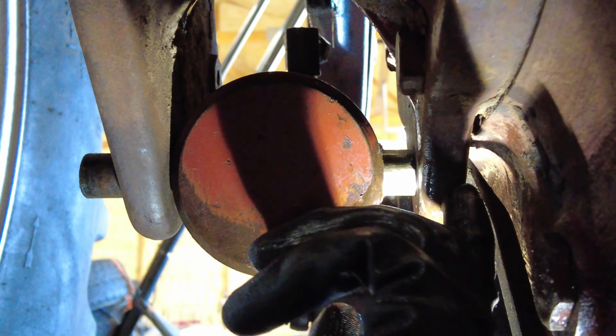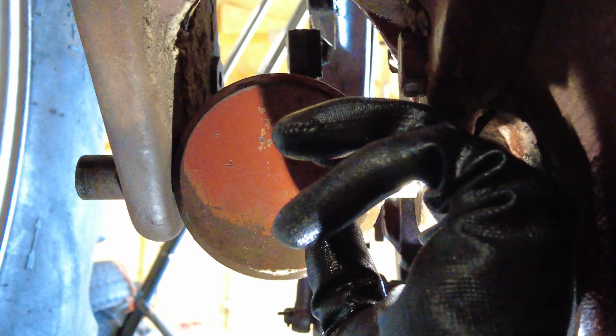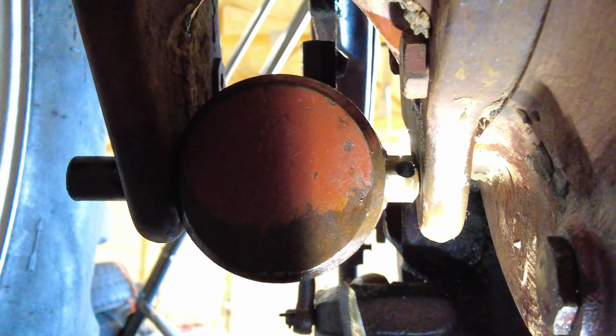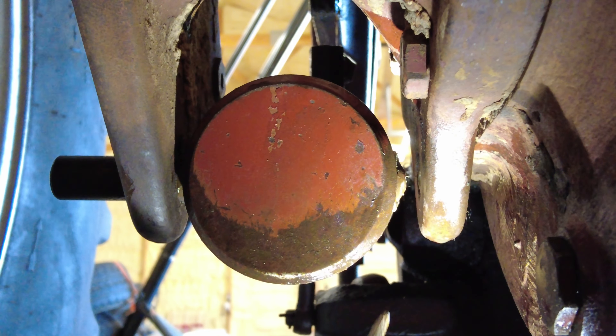Take this nut, I'm going to put it in where that pin came through — obviously make sure you get one that's going to fit through that hole. Once you do that, go up there and do the same thing again and you just keep pressing through. I'm going to keep adding another nut each time until I can't anymore, but once it's all the way through, on the other side I can use the casing of the hydraulic cylinder itself. Alright, see — now we're through. I can push that cylinder back and now we're out of our bind.